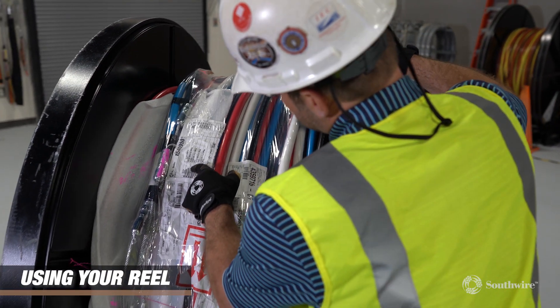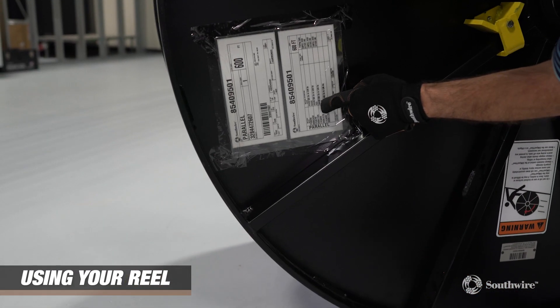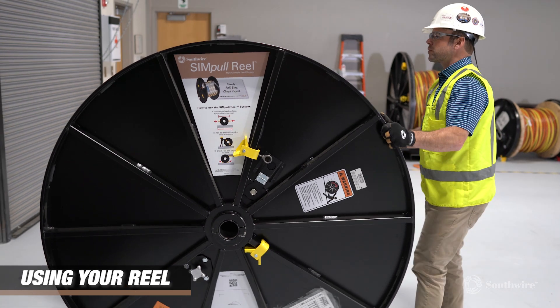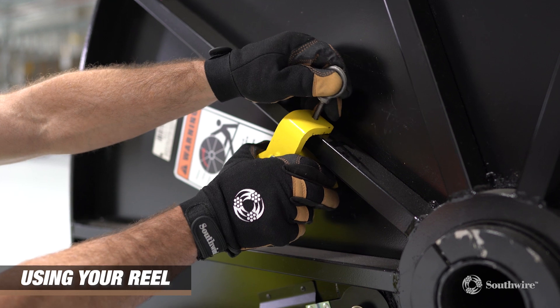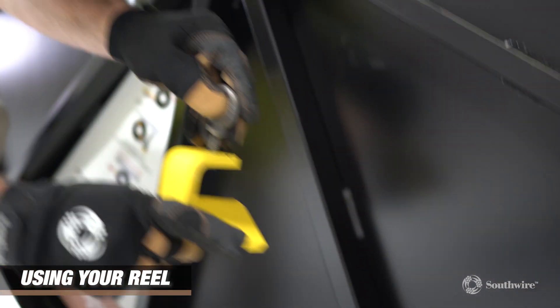Confirm the tagged plastic label printed on your wire, which contains the name of the rail as well as cable type, size, and length, and verify it matches your order. Roll the Simple Rail as close as possible to where you are fitting the wire. Place all four chocks between the rail and the ground when pulling cables and/or storing a Simple Rail.